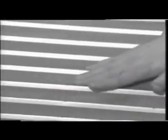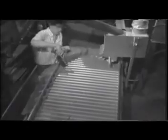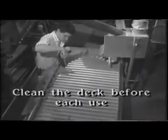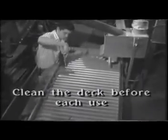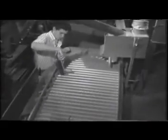Another thing to watch for is roughness of the deck. If, after a lot of use, the deck surface becomes smooth, the product will not be able to climb up the slope because friction is reduced. Then it is time to get a new deck. Yet another item to keep in mind is that the deck must be thoroughly cleaned before each use. If any area of the deck is plugged up with fines, the airflow in that area is affected and separation will not occur.